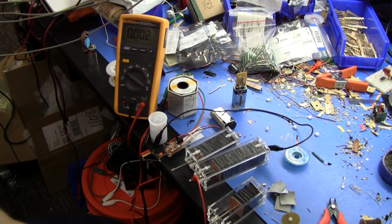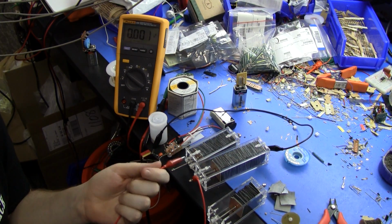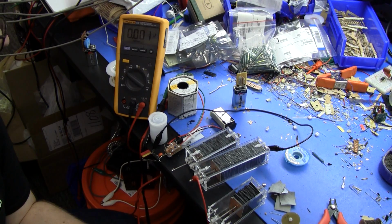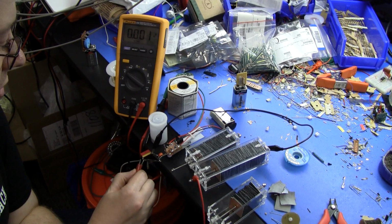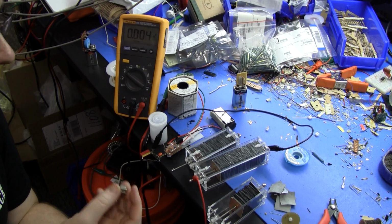Okay, so now that we've put the scary battery away, we can go back here to the bench and try it with some of these far less dangerous dry piles. So this is the first dry pile that I built. This has aluminium and manganese dioxide. Now I'm going to zero my little electrometer here, and I've already connected up the negative pole. I'll connect up the positive side to the capacitor for a few seconds, disconnect it, and then transfer the charge.